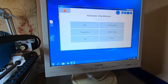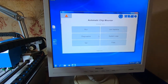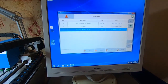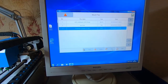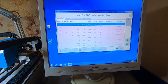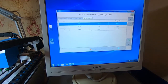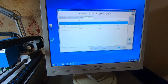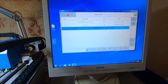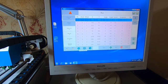Unfortunately I don't have any screen capture software on this PC so I'll just have to point the camera at the screen. What we do is open the file that we want to run. If you haven't set up the origin points and alignment points previously then you'll need to edit PC calibrate and enter the points that you want to use, but I've already done that with this board. It's just really a case of deciding which points you want to use. So select the program, load it and now we will calibrate the board for this actual run.